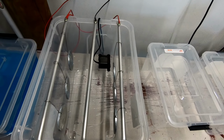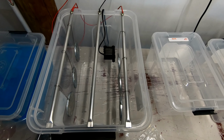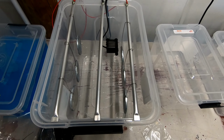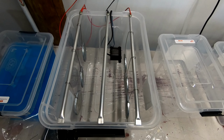We've got to do a procedure called a cooking out procedure, and what that does is remove any scum or impurities. So we just need something we don't really care about, just an old bit of metal or something, just to put in there and zinc plate, and that'll get rid of all the scum before we start doing the important things.